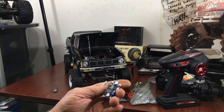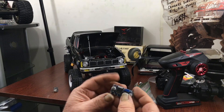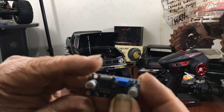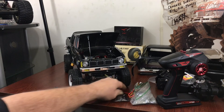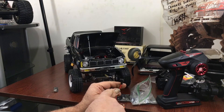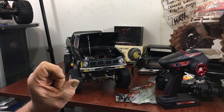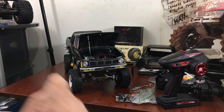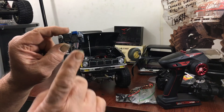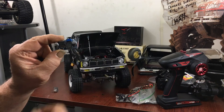There's a tiny little adjustment screw right here. I have two of these in there — they're really compact and small. I soldered them up: they show an in and an out. The outside is positive and negative, the inside is positive and negative. You hook your positive and negative from your battery on this side, and this side is your output positive. If you don't have one of these connectors, you can get a wiring crimp and a piece of wire and stick them in. They'll stamp right into the plastic shrink wrap on the wire terminal, and on this side you just solder a little ground.